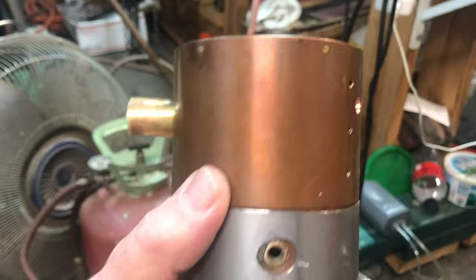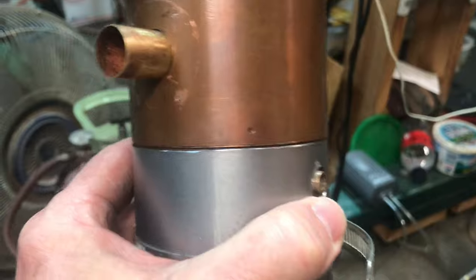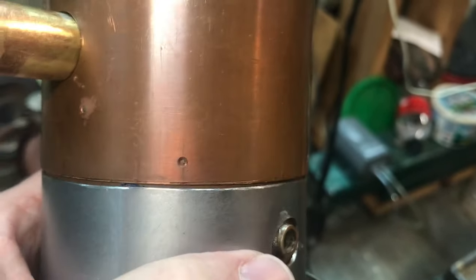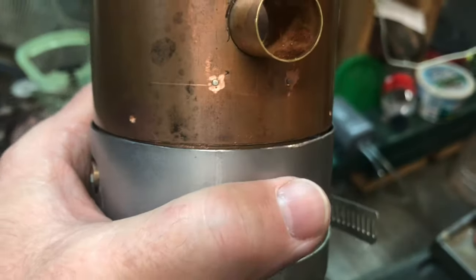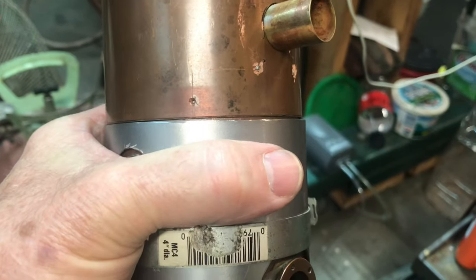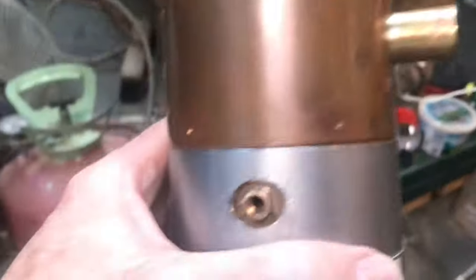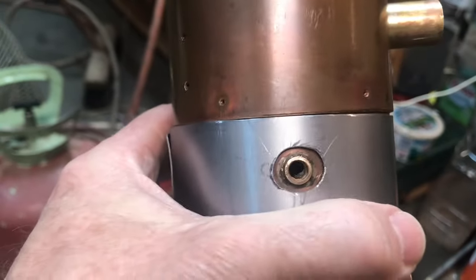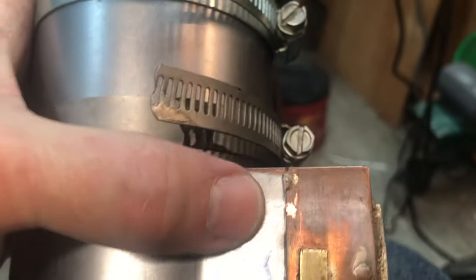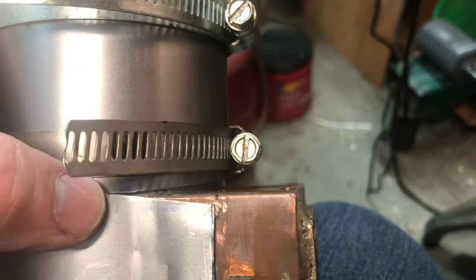It's Monday night and I came back and fitted these hose clamps and got a really nice fit. I had to trim a little bit away from the front edge — the leading edge of the boiler jacket — in order to provide clearance for the smoke box to fit on there properly. I just did it freehand using some tape to mark off the space and these shears. Here's a pile of stuff that I've trimmed off, most of it from around the smoke box area.